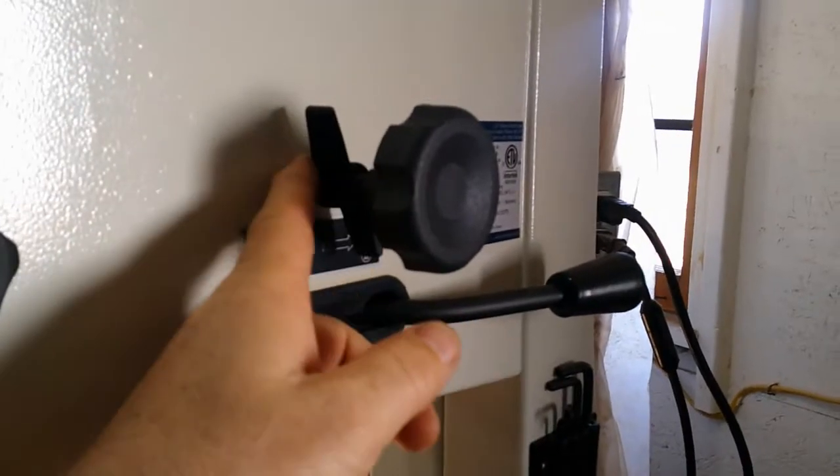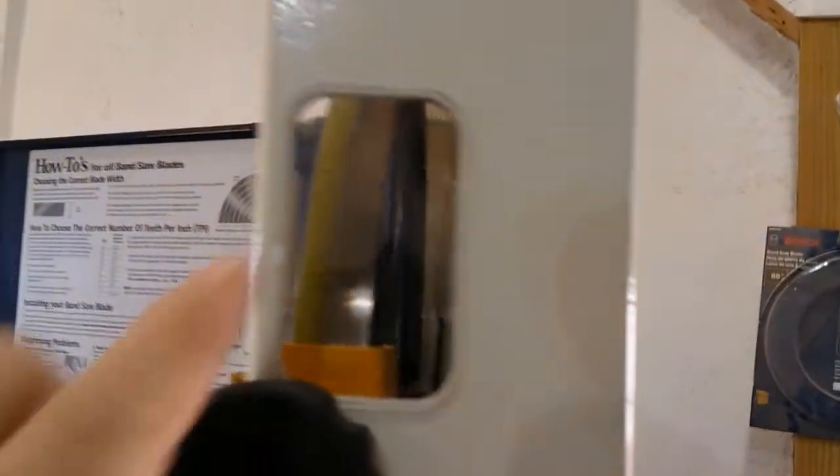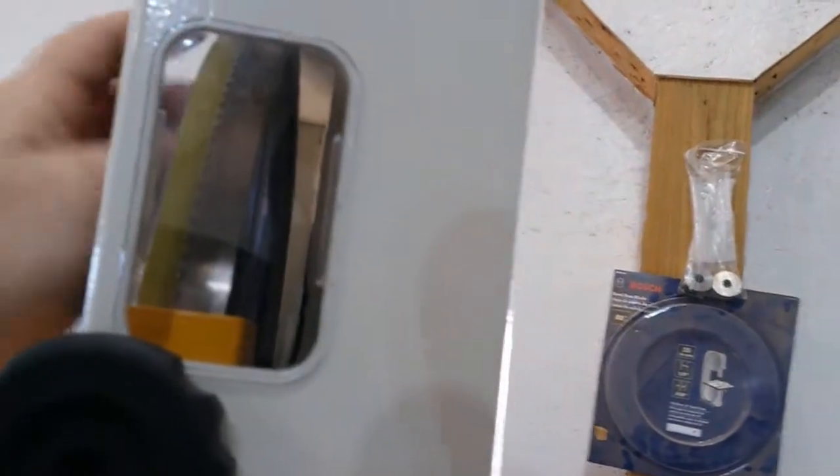If we swing around to the back — I'm going to move this saw — we have our blade alignment adjuster right here. Loosen this lock nut, you can turn this in or out while looking through this window, and you can put that blade where you want it. Now manufacturers tell you to put it one way, but Alex — and I hope I don't get in trouble for mentioning his name — says to put it somewhere else. I go by his method because it's perfect, and that method is the teeth right on the center of the wheel instead of the blade in the center. You can watch his video to find out how he sets up his saw.